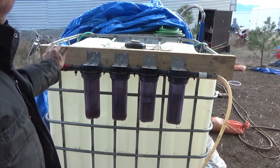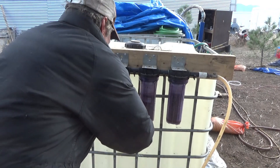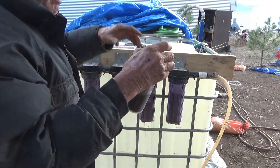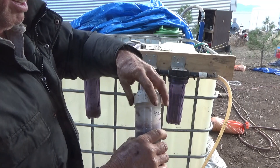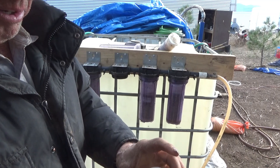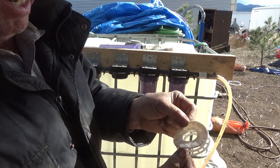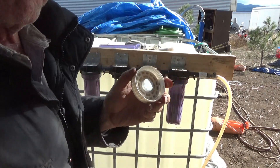Yesterday I came out and just opened that valve wide open. There was one other modification though. Here's the resin cartridge — I've taken a little bit out of the 400 grams because I was having problems with flow, and I thought maybe it was just packed in tightly. What it actually was is right in here there's a disk of fiber to act as a filter to keep the resin in, and unfortunately it was plugging up with silt. I've cleaned them all out.